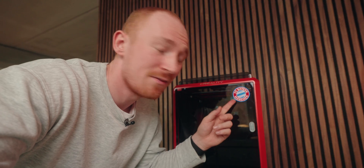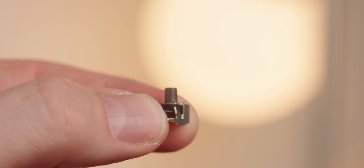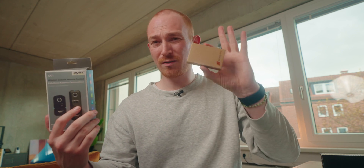Please note that I'm not an FC Bayern Munich supporter — this is just the one that Creality sent me, probably because I'm German. But let's not talk about it. My plan to trigger the camera with the 3D printer is hopefully really simple. First, we have this wireless shutter remote that's easy to use with any camera. Then I have these tiny little switches — I'm gonna solder the switch into the remote and then put this little tiny switch inside the printer so the printhead can actually touch it, which we'll do in G-code afterwards.